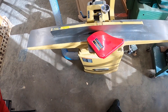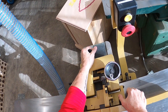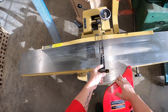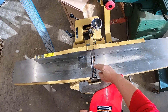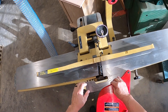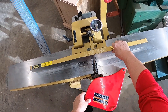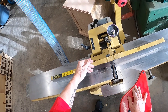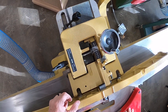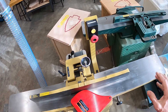Let's talk about the fence. If we unlock here, we're able to move the fence. After some use we may find a blade with a nick that's not cutting perfectly, so we can move the fence. Or if we had a wider board, we might want to move it. Once we lock it down, it is stationary. We can also tilt the fence — we unlock it and use our wheel. Right now I've got it dialed in to zero.